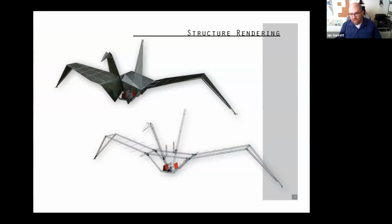It's made out of 12-inch aluminum truss, primarily, with some custom fabrication in it. Because it's in a desert valley, which has huge temperature shifts over the course of the night, it's got driven points in the abdomen and wingtips, which are about 150 feet apart, so that it could withstand hurricane force winds. You know, the obvious thing should be that if you are designing something to look like a bird, and in a windy area, it has the ability to take off over time.